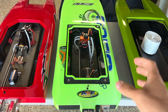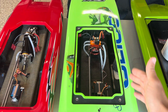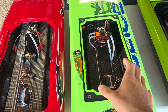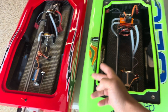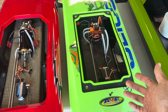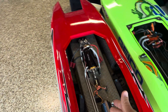As much as I love doing inlays — they look cool and they reinforce the boat — this boat has a full inlay minus the motor mounts. But it's not always necessary. On this boat I did a full inlay, but the floor itself doesn't really need it as much as the seams do. Running the inlay up the sides and around the top — the real benefit is covering up the seam so the seam is stronger.